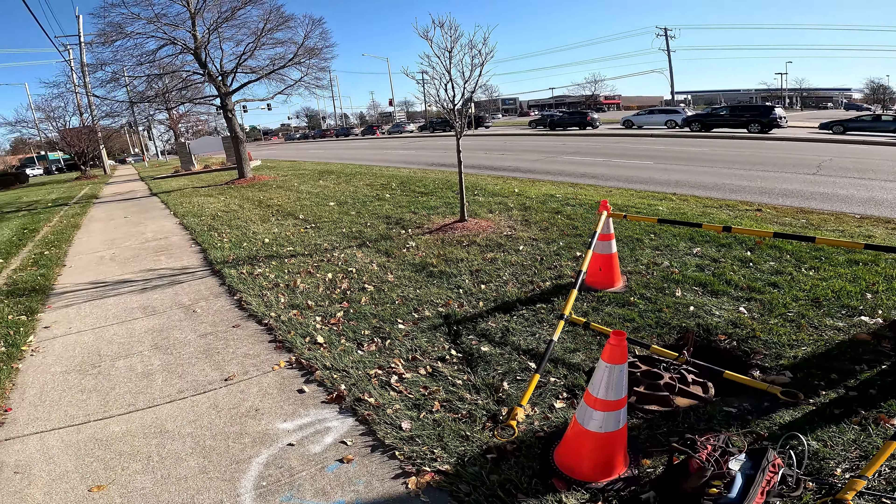These guys don't like potholing or nothing. So if I don't mark it right they're going to hit it. And I see blue flags over there — I'm wondering if this main ties into that main that belongs to a different township. I do got footage off the print from that valve — it says 116 feet. I'm wondering if this one ties in here and doesn't show it on my print. Maybe it ties in here at 116 feet. This looks like about 116 feet — we'll see if it takes me there, folks.